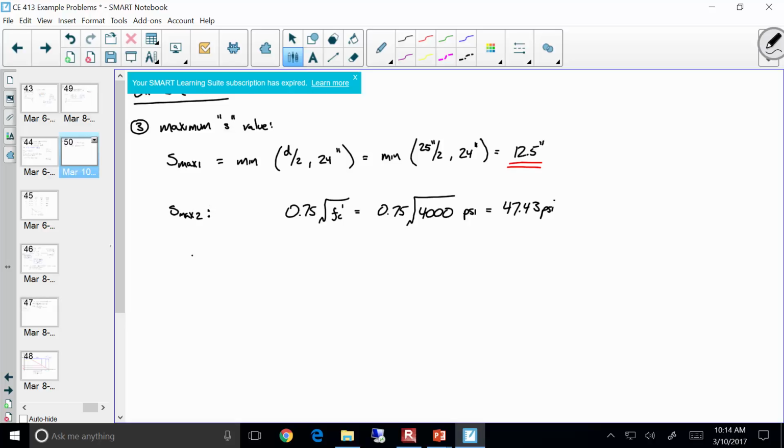So I propose that S max 2 is A sub V, FYT divided by BW times 50 PSI. So help me out, plug and chug. What is AV? There we go. The units matter. Now, what's FY? No, it is 60 KSI, but what should we use? There we go, 60,000 PSI.